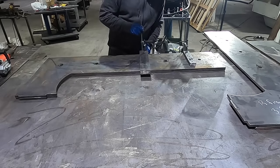Now what I wanna do is weld the legs on the side. It's a big frame that goes on there. It's like a big box. But I'm gonna weld just the sides on so that I can set it down on the ground with a forklift and then lift it up onto those legs, and it'll give it support. Because without those legs, it's real top heavy in the front. It's just gonna wanna lay over.